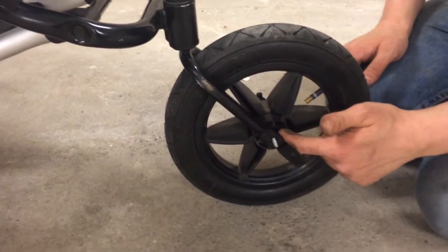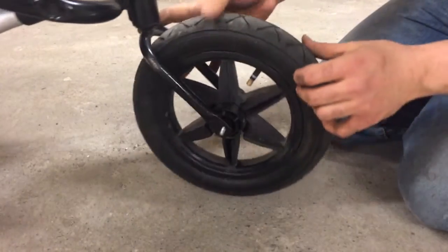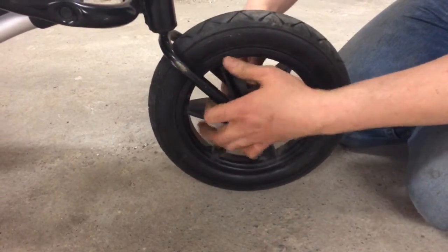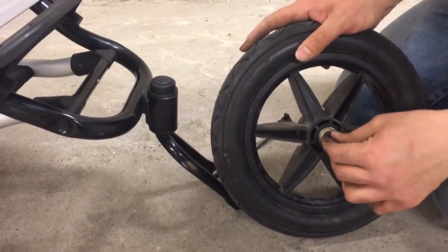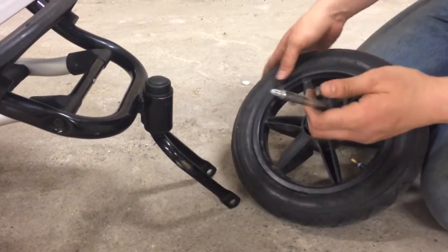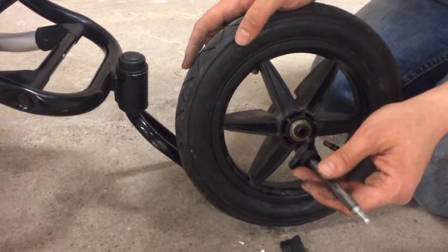It's good to oil inside here every once in a while, especially on the side where the ball bearing is. There's actually a ball bearing under this plastic part as well. The reason for this oiling, among other things, is that in addition to needing oiling for the ball bearings, if this rusts tightly inside, then you're going to have trouble and you're going to have to knock it out with a hammer should you have to switch any parts later. And that can be expensive.